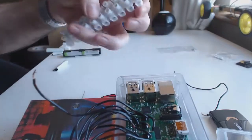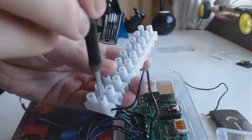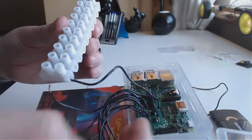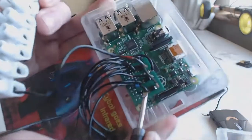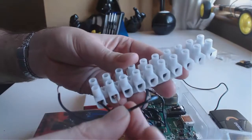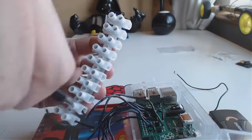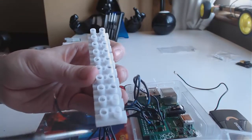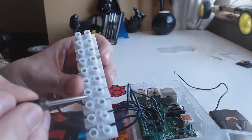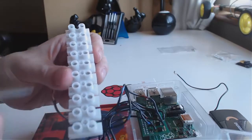You're going to follow that down and put it in this terminal here, and screw it down real good. Then take the minus wire and the minus one can go on the next terminal. So that's the first motor ready to go — if we put a motor on these two now, that motor will be happy and drive away. I'm going to do that for motor two, motor three, motor four, and then I'll do the power at the end.